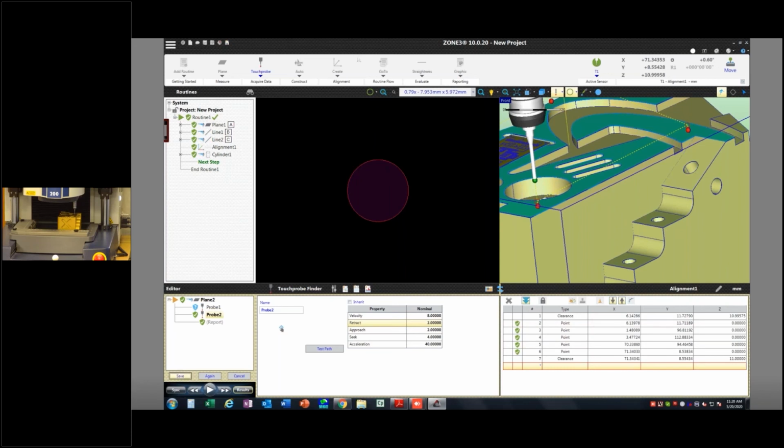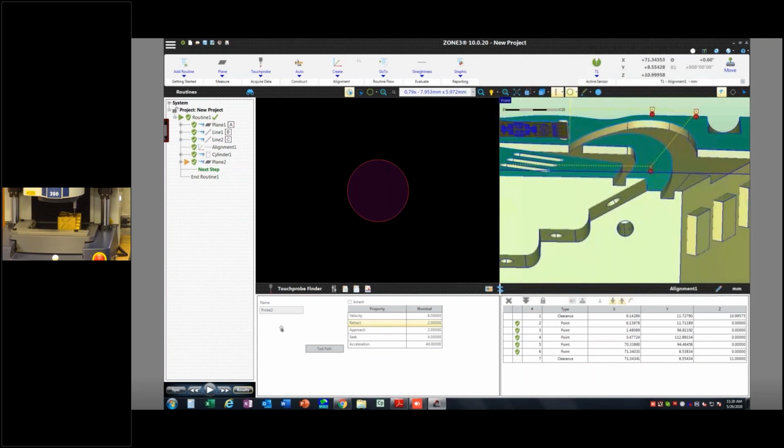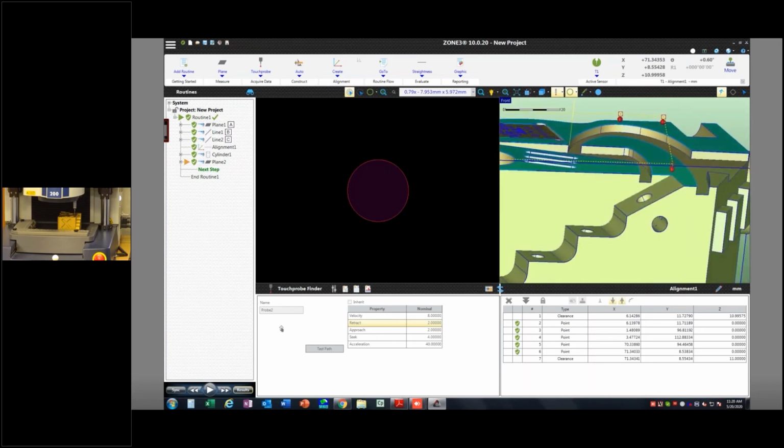One other technique I wanted to show you real quick with this probe while I have it on here is the idea of a cutting plane. So for example, let's say I want a profile of a 2D curve right here on this set of radii. Now I can't, they're actually cylinders, so I can't just treat them as one surface.